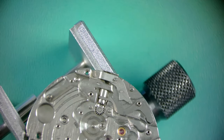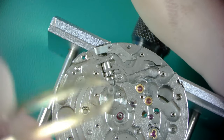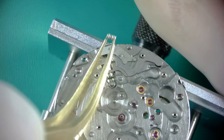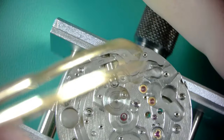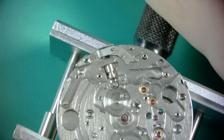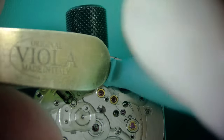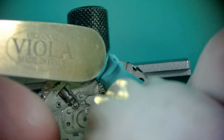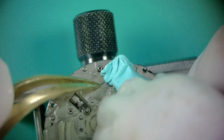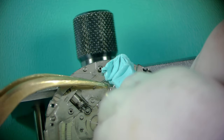Normally I should study the movement and make sure I really understand how everything functions together before disassembling it. I've never worked on this particular movement before. That said, it tells you exactly how not to do it, so later on in the video when we put it back together you'll see the right way. You're looking at the intermediate wheel here — it has a radiused cut on one side of the teeth, and there's also a raceway ledge on the bottom side where it sits on the main plate at the right height.